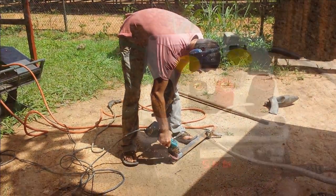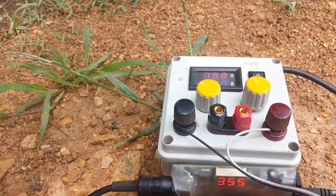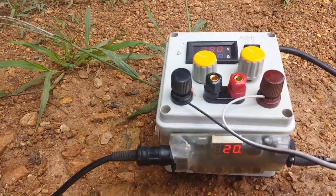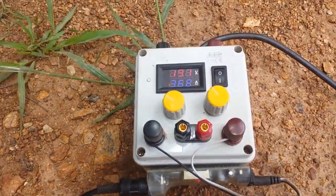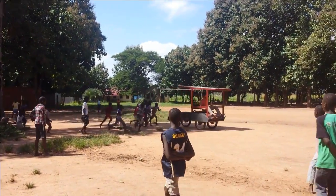I also have a variable power supply which I can use to power my soldering iron for electrical work. The biggest thing I'm working on at the moment is a PID control loop which will adjust the motor power to keep the vehicle tracking correctly, based on an angular position sensor at the point of articulation.